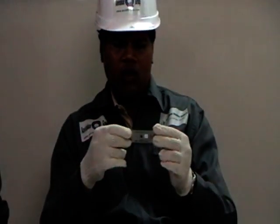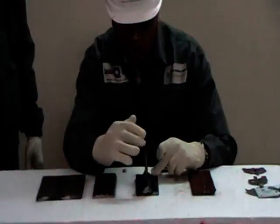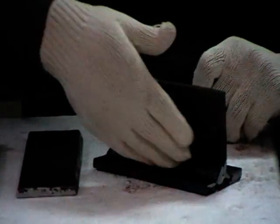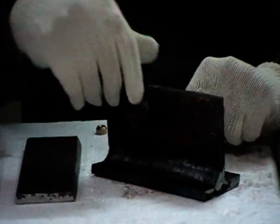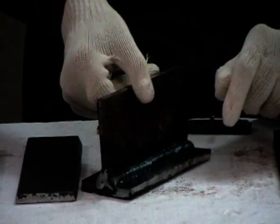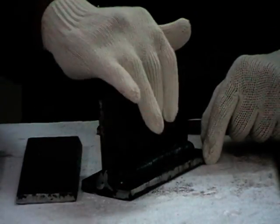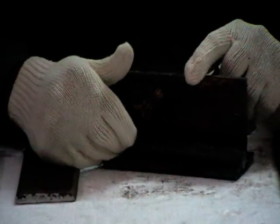Today we are going to demonstrate how the measurement of fillet is done. Considering this weld — this particular coupon is divided into two parts. One is having a concave weld, which is dressed properly to make it concave. The other one is a Convex Fillet which is normally used in production — a very popular weld. This is only done on a job which has a dynamic load requirement, as mentioned in the drawing.